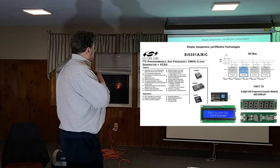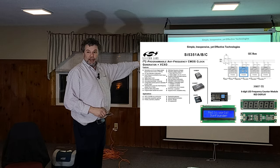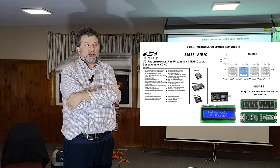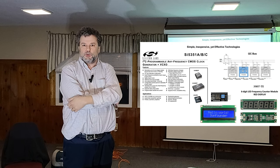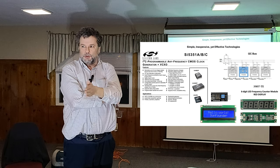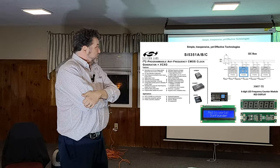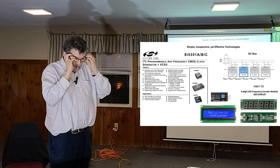There's some amazing stuff out there if you can have a nice package of glue around it. This is the Silicon Labs SI5351A, a very popular chip that's been around for maybe five or six years. It has three programmable digital synthesizers on it, each of which will put out any frequency you'd like up to 200 megahertz. You can also coherently control the phase - put out something on output zero and have output one be exactly the same frequency but 90 degrees out of phase.